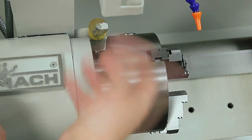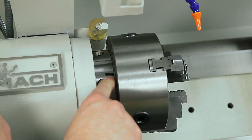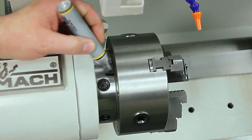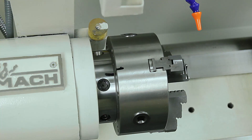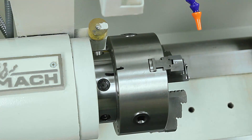If you get one that's off a little bit, you can just adjust the thread. Now that I've got the chuck in there, with the mark I put on the spindle face, I can put another mark on the chuck itself so they line up. Now when I put the chuck on and off, all I've got to do is line up those witness marks, and any soft jaws I made should repeat pretty well.